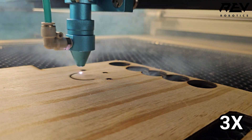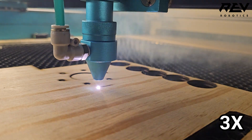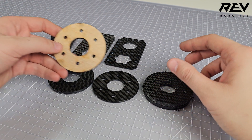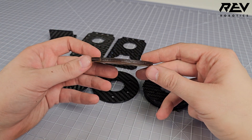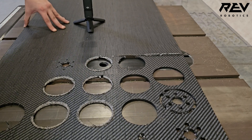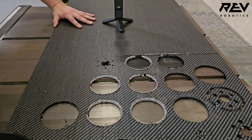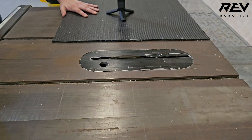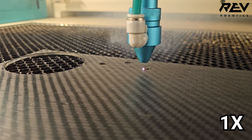The result is an exceptionally strong, rigid sheet with significantly higher strength than standard polypropylene. For fast and precise part fabrication, CO2 laser cutting is the most efficient method. To minimize material waste, we recommend prototyping with plywood before finalizing designs in Max Composite. When resizing sheets for laser cutter bed sizes, conventional tools such as table saws, band saws, or jigsaws can be used. However, avoid overheating and rapid air cooling as these can cause jamming with high-speed tools.